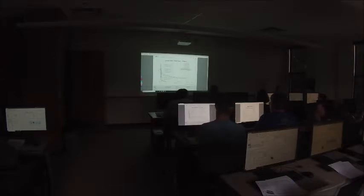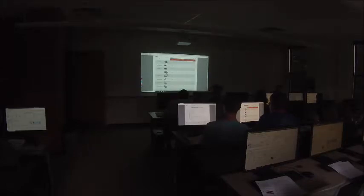You've got to cut the voltage down to 6 volts before you really start to get any kind of length of time at stall that the motor survives. So this graph really helps you tell how durable the motor is. Okay, so that's the 775 Pro / Redline. I'm sure we'll use some of them next year. If I have time at the end, I want to talk about those a little bit more.